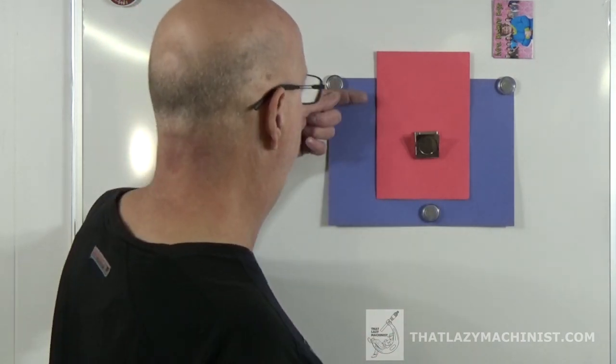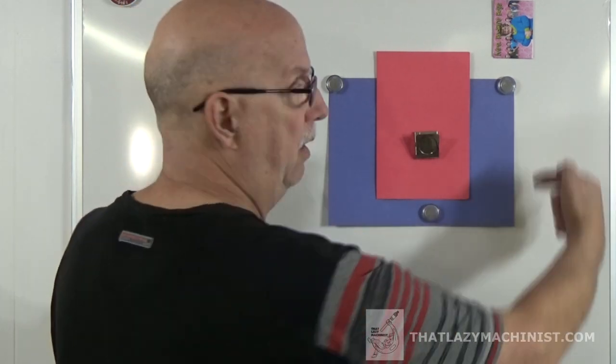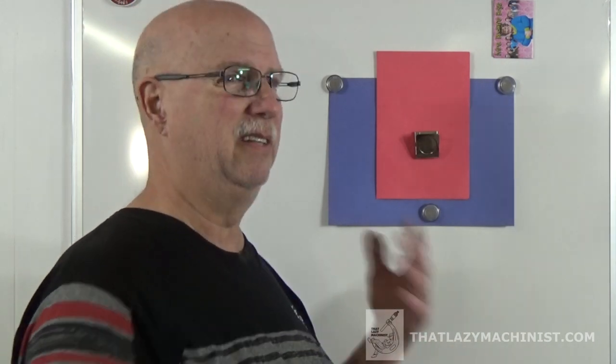Another way would be to set up a stop up here and a stop down there to impede that possible rotation. And that's possible, but you'd have to have threaded holes on the sides of your vise that can accept an adjustable stop. And well, not all vises have that, so that wouldn't be possible for most people. The fourth thing would be to set the vise at 45 degrees. It would make for a shorter cut, but I'd have to have a long stroke, even though I didn't need all that length of stroke. So that's sort of half and half. It's not perfect and it's not good either. It's somewhere in the middle.